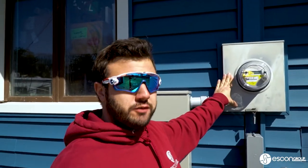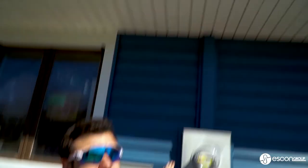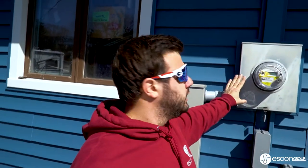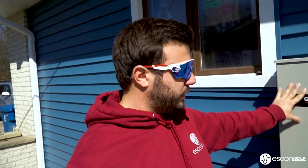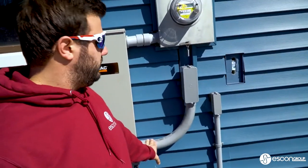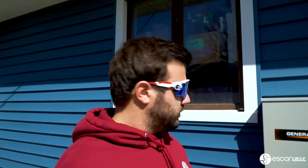From here we have our utility service coming in from the pole. We reroute it — instead of going directly to your panel, you route the wires to go into the transfer switch. From the transfer switch, we then go into the house, into the back of the panel. Sometimes it's that easy, sometimes it's not. So now we have wiring that goes from the transfer switch down and over into the back of the generator, which you will see here in a second.